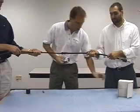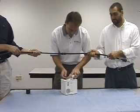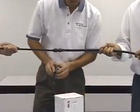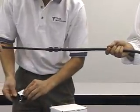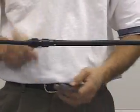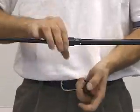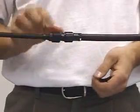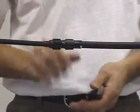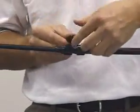You're going to cut off a small piece of the mastic, and that is going to be put right here where the connection is, where there's that little dimple in there. You don't want the mastic when you make the wrap around to sink into any sharp edges, like on a bigger connector. You'd have a much larger area there, and it might give it a chance for the butyl to rip or to stretch out too much.